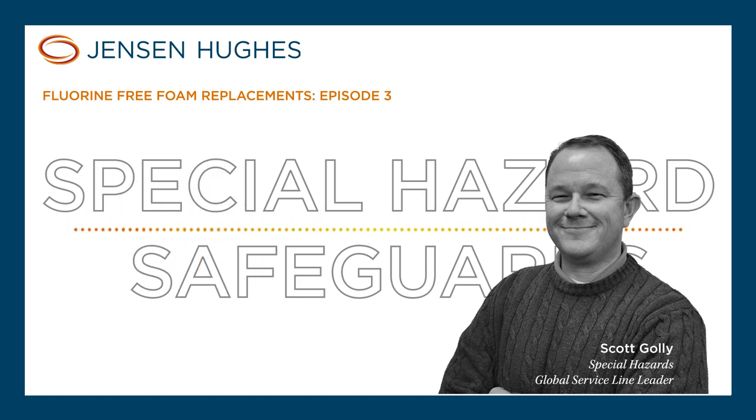When you look at the system, make sure that you're looking at the hydraulics of the foam. If we're looking at a far more viscous product or even a non-Newtonian fluid, we may not be able to pump it with any of the equipment we have. So make sure you're working closely with the selected manufacturer. Looking at the key firefighting capabilities, increased aspiration is really critical — five or above is what we're looking for. Some manufacturers will tell you they don't need to aspirate their product a lot, aspirating somewhere in the 2 to 8 expansion ratio range.